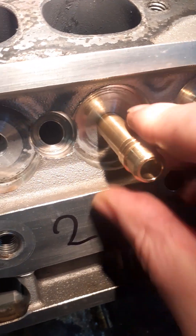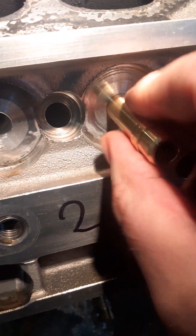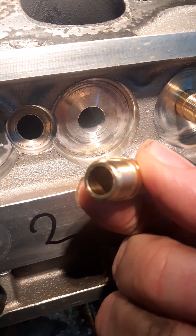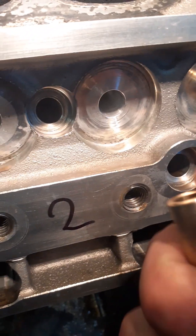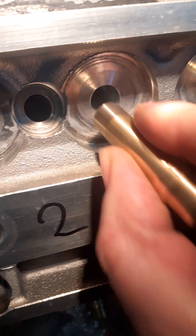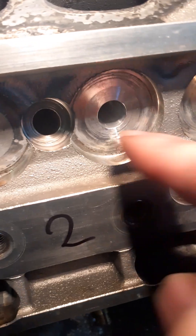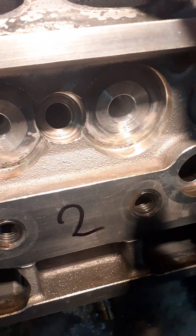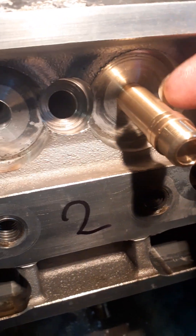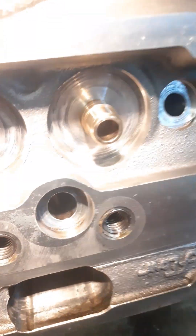So you start straight - it's not like you have to press it in at an angle. The start is already good. This also takes care of a straighter bore for the valve stem to begin with, and you will not damage the piece by driving it in crooked. You can also use an old valve, turn it down a little bit, put it on the valve seat so it sticks out, put the valve guide over the shortened valve stem, and then press in and go from there.